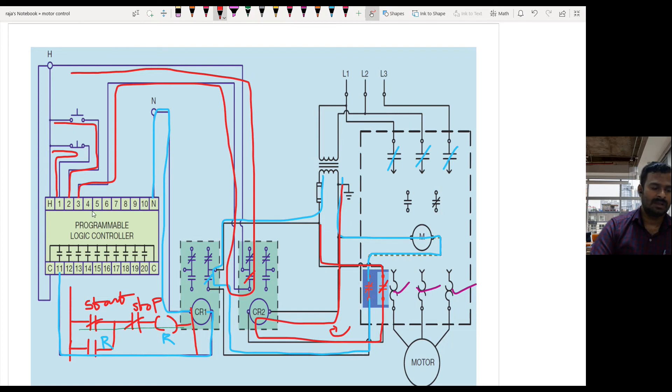With the help of this input I can either display that there is an overload condition, or I can have an interlock system so the motor will not switch on until the problem is rectified, or I can use this input for notification or any other logic. If you don't want to do any of this, we can avoid control relay number two and use only the NO contact to display or indicate with an indicator lamp. This is how the three-phase induction motor with DOL starter is achieved with the help of PLC, contactors, and overload relay. Hope it is clear. Thank you for watching — if you have any doubts please let me know in the comment box.